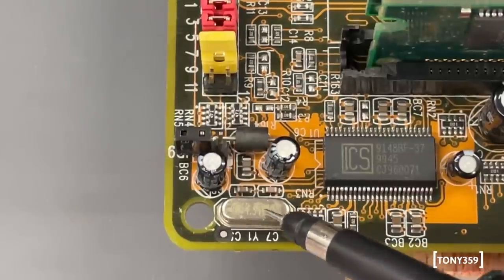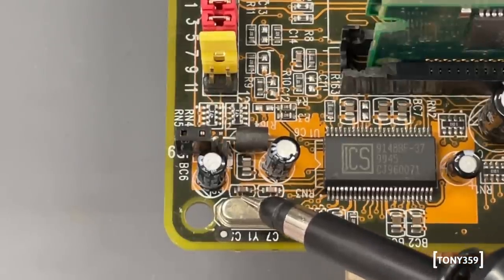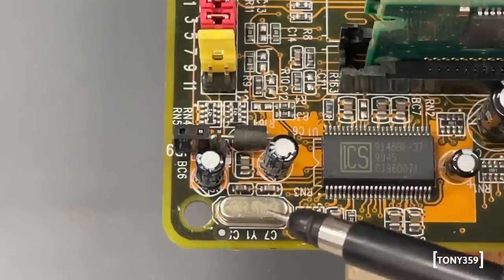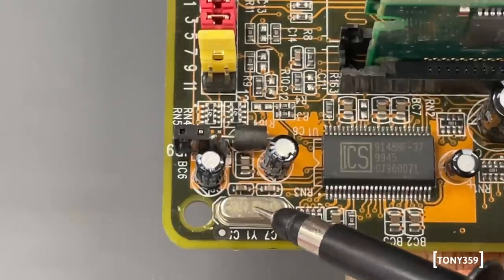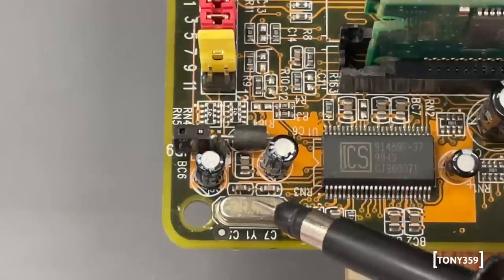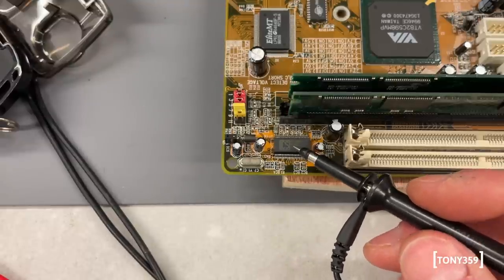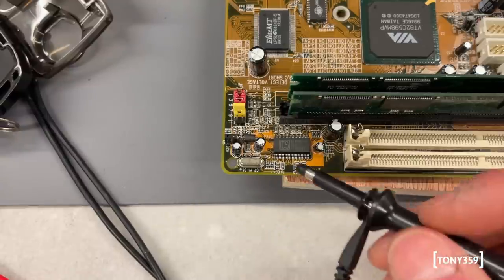I also don't think there's a way to reduce the frequency on pins 25 and 26 for USB and SuperIO - those should always be 24 and 48MHz. Looking at the datasheet, the voltage reference for the crystal pins X1 and X2 is VDD1, which we already checked. Let's double-check just to be sure since it's important for the reference crystal. We have 3.5 volts as before - not the problem. Focusing on the crystal circuit: there's really not much here. A trace comes out, goes through a capacitor, and to the IC - same on the other pin. Nothing unexpected around the crystal. Before spending more time with the multimeter, let me check the thermal camera for anything obvious around the IC.